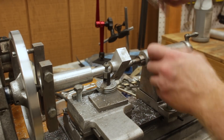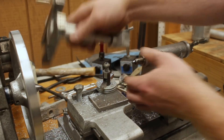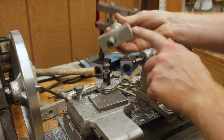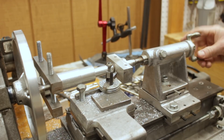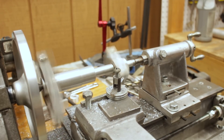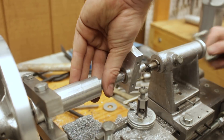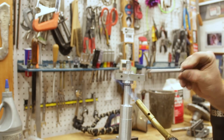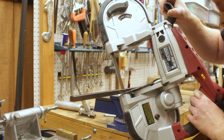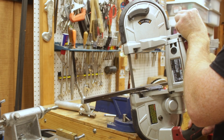After I had the bosses cleaned up I went ahead and cleaned up the yoke bottom casting. I put it on the arbor and trimmed down the sides. This makes it a little easier to line up with the yoke arms. Having a little recess on either side helps ensure that the bore is perpendicular to the yoke arms.